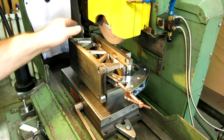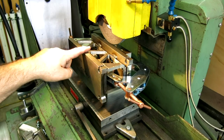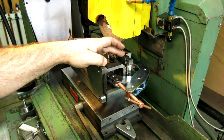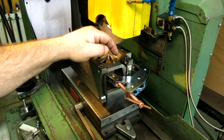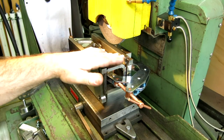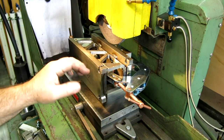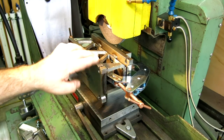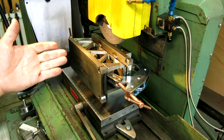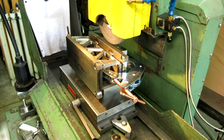All right, this is a little bit of an interesting setup here. I want to dust these side rails off while I've got it going here. If it just sits directly on those, the sides are out of square to it, actually a fair amount. So I've got one of my fresh ground sides up against the angle plate here, and we're clamped up, so we're going to dust this off. Then I can flip it over normal on the chuck and dust the other side parallel to that. But just do it now, get it close, and then we'll see how it comes out after heat treat.